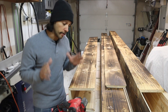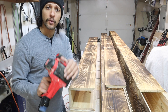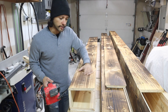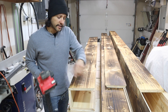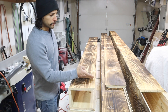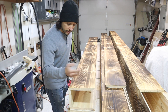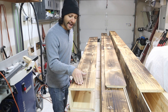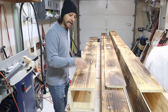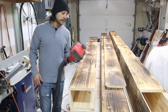So that was the fun part with the torch. Now the next part is kind of like the equivalent of sanding. I've switched to a wire wheel on the restoration tool. The most important thing is when you're ripping this with the wire tool, you want to go in the direction opposite to the chip of the axe stroke. So we had the axe hitting in this direction, so we want the wire wheel ripping up this blunt cut. As it goes over the axe mark, the wire wheel will catch in the chip and rip that out along with any soft or sapwoods, making a nice texture. I have it hooked up to dust collection — throwing on some ear protection and we're going to scuff this thing up.